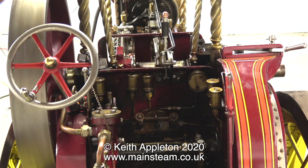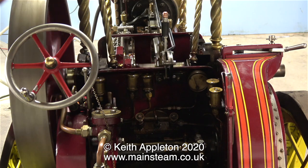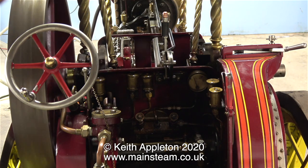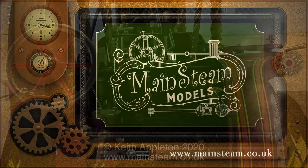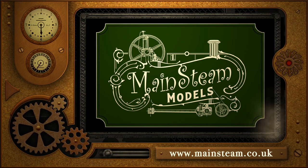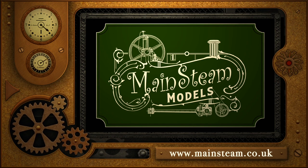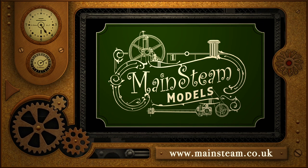And that's where I'm going to leave it for the moment — a driver's eye view till the end of the video. The water gurgling noise that you can hear is the crankshaft driven water pump returning the water back to the tank because the bypass is open. I'd just like to say, on the 1st of May 2020, in these very strange coronavirus lockdown times, make sure that you stay safe and stay well. Thanks for watching and I hope you found it useful. Please take the time to visit my main steam models website and click on the section that says video playlists — that way you can find other videos you may like to watch and watch them back to back.